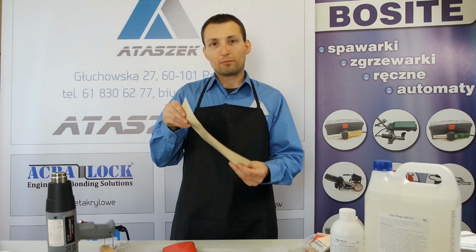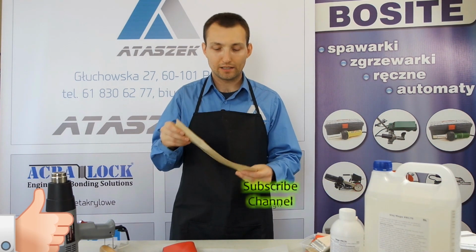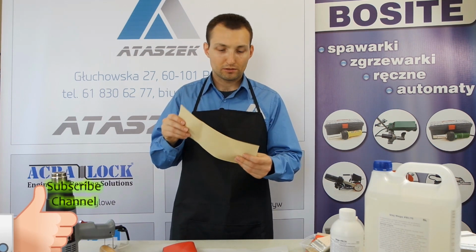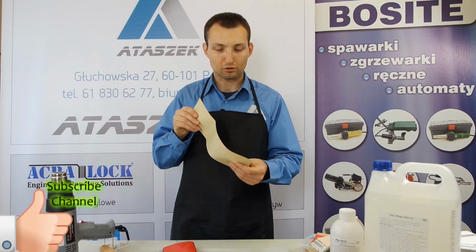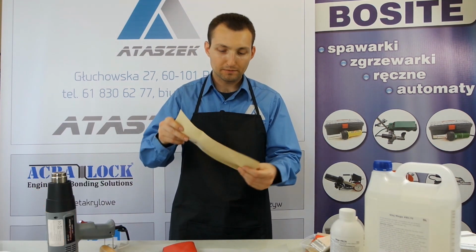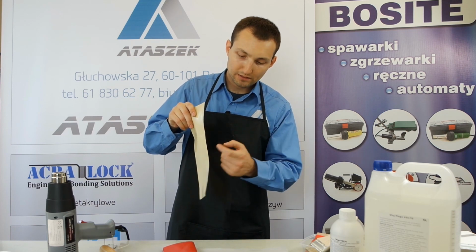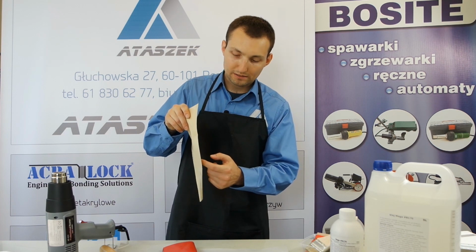This kind of material is present as a coverage of pickup cars, lorries, tents, and you may also, which is very common, make waterproof bags, casings and other sort of products where the material needs to be elastic and strong. It is thanks to the way it is made. The upper layer is made of PVC, then we have a fiberglass net and PVC again in the lower layer.